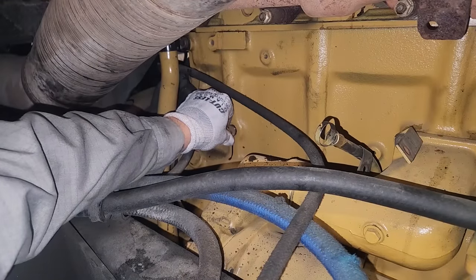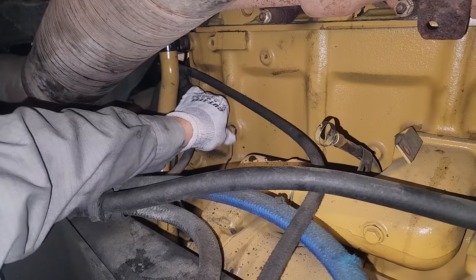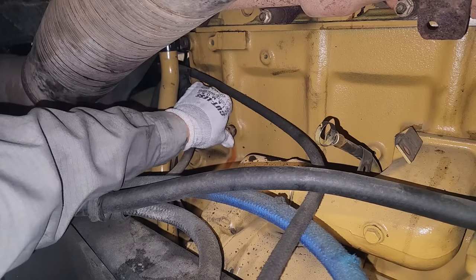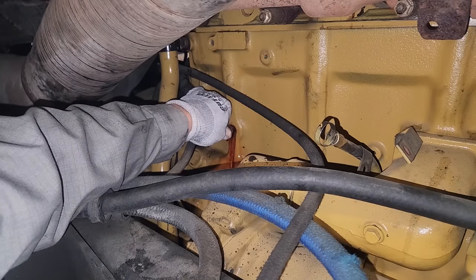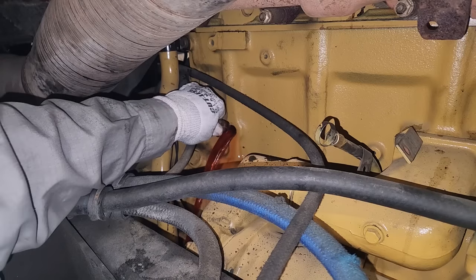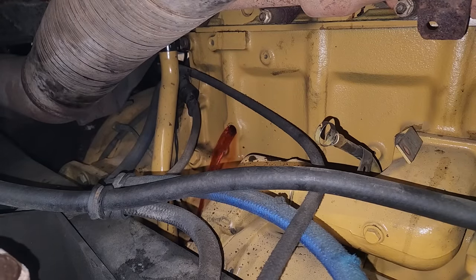We're pulling this plug out. You can see we're getting some liquid out of there — it's dirty, but that's kind of normal at first; you'll get some accumulation around fittings. It's turning reddish-clear now, which means there's coolant there. We're going to drain the block and find out. We've got a really good amount of coolant there. Notice the coolant's very clean — it's red, no debris or anything, unlike that shunt line that was just full of junk. Just trying to figure out why that one part of the cooling system was so clogged up and the rest is not.